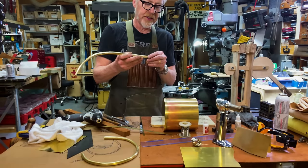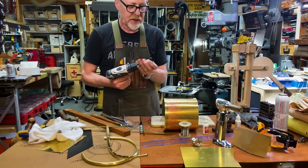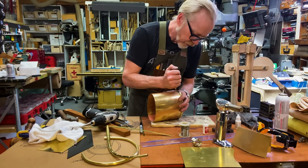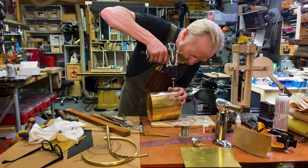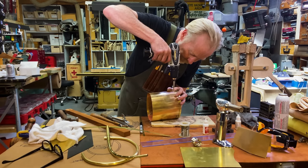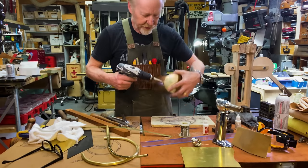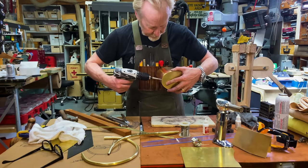I'm also working with a step drill whose biggest dimension is exactly the dimension of my fattest pipe, which is great. I am going to start straight in, but then I'm going to angle it so it fits the pipe. And I believe if I come in here right like this, all right, I'm through. Now the trick is to angle this because I want this to be like this. So it's a fairly steep angle. So I'm going to come in.